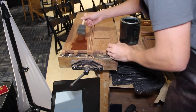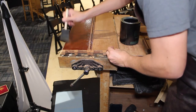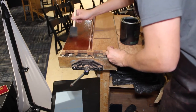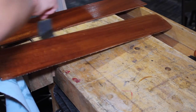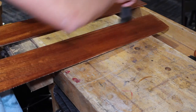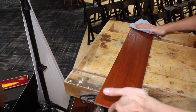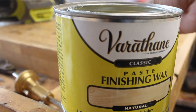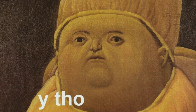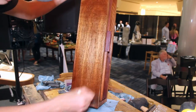Since this is my submission for the Rockler Bent Wood Challenge, it's only fitting that I used Simple Finish from Maker Brand Company. I assembled this for a live charity auction with the Salvation Army, so having a quick-drying finish was a must. It's literally a wipe-on wipe-off finish. I finished the inside of the cabinet first before glue-up and assembly, rubbed some paste wax on the tambour door track, and then applied Simple Finish to the outside of the cabinet as well.